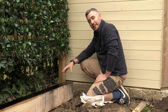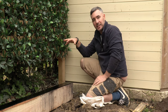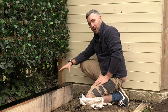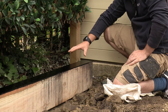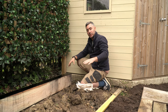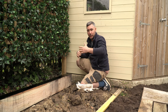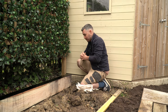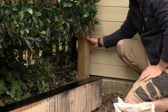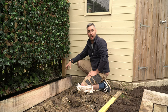We're going to be stacking these sleepers on the narrow end and not the wider end. This is to give us extra height without using so many sleepers. These oak sleepers aren't cheap, so we've bitumened the bottom of the sleeper which is going to be in contact with the ground. Normally you'd have to put in corner posts and posts for each of the joins, but because we've already got a post concreted into the ground in the corner here we're just going to tie into this rather than putting another one on the inside of the sleeper.